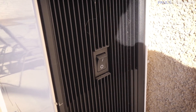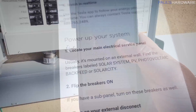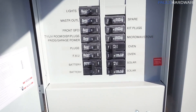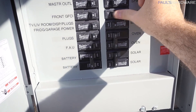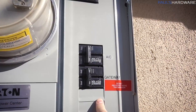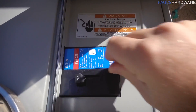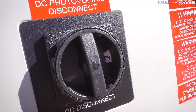Looks like the Powerwall is already off as well, so I don't need to switch that off. And finally the main breaker — also off. Everything is now off. So if I'm reading this right, I want to do the breakers on first on the sub panel, then I need to turn on the external disconnect, and then I turn on the inverter. Let's give this a shot. Spare was off. Battery. Solar. Solar. I don't think the AC should matter because it's not on right now. Gateway. Main. I heard beeps inside, so the power's back on. And our DC disconnect into the on position. The battery — the Powerwall. It made a noise.